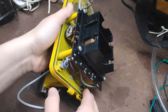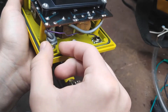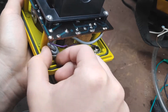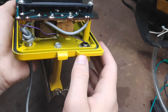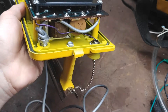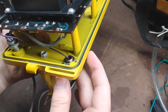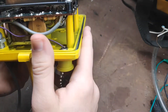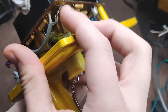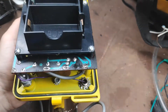You'll notice here that the Geiger probe is held in with this bolt, so you also have to unscrew this bolt here. Just unscrew that, it shouldn't be too difficult. There's also a knot there — I assume that's to stop you from tugging at it and pulling it through. But we can tie that ourselves later. There are two soldered joints that we have to desolder: there's one ground right there, and then there's one attached to the circuit board.